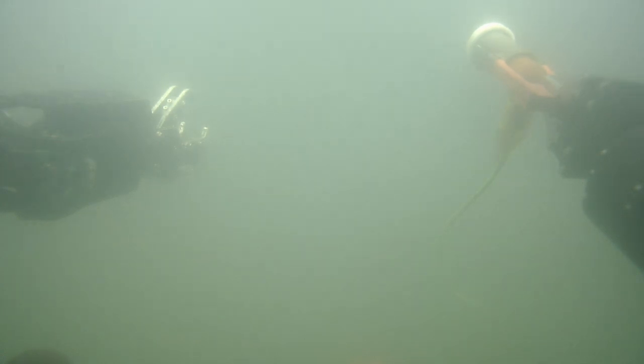But I would advise to come up and just keep it there in your sonar. All right. Should clear up, and just let her float up, eh? Don't thrust up. Yep. You might have to pull back on your Z-bias a little to get your thrusters to null. It's going up. So as soon as you come up, start lateraling right a little, and okay, kick in auto out. Or just watch your altitude there. So yeah. You're up 3 meters now. Come back down a little.